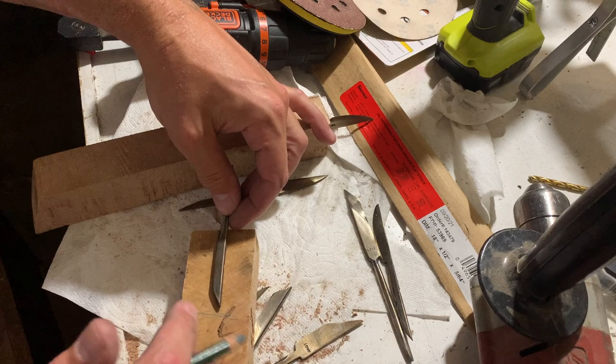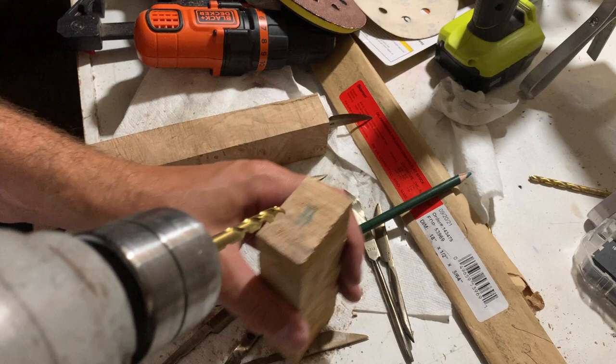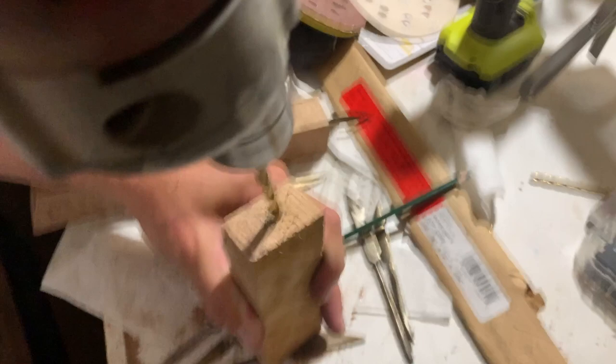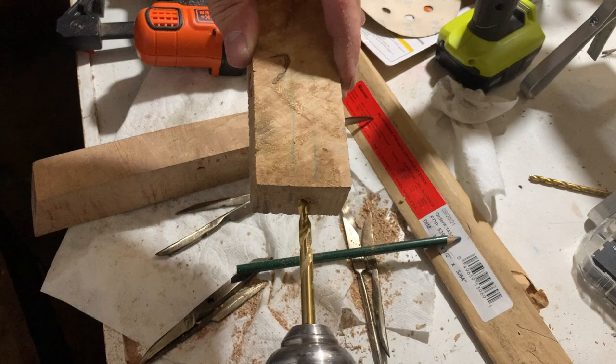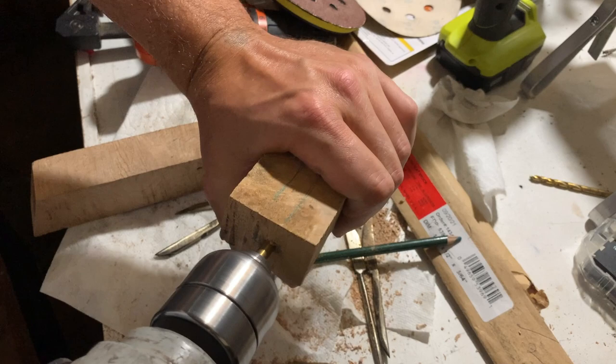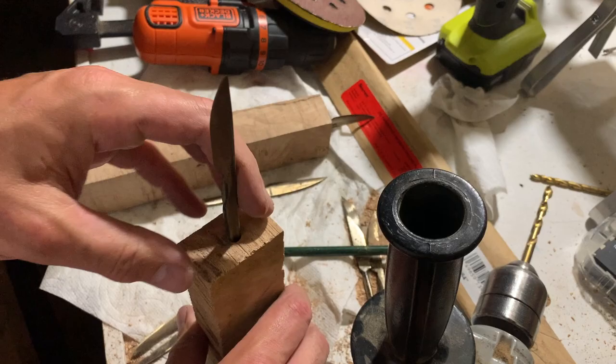All of these are hidden tang knives. You're going to want to drill two holes and make them meet in the middle. We have a rectangular tang, so if you just go the diameter of the tang with the drill, you're going to have a huge hole. That'll work on some early tangs if the tang is really small, but for the most part you probably want to try to make a rectangular hole, or as close as you can to it.